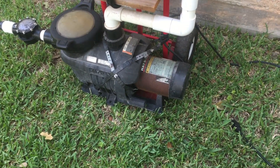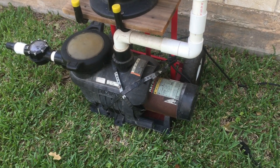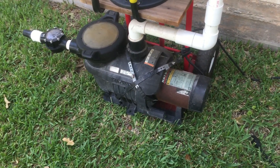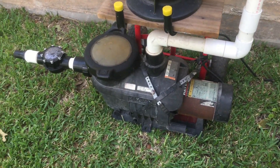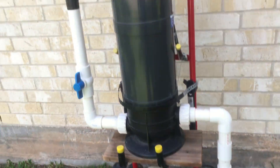If you think about it, above-ground pool pumps always have water coming straight out of the side of the pool, straight down to the front of the pump — that's why they're not self-priming. So if you're going to build a portable vacuum unit, I would suggest you use an in-ground type self-priming pool pump. I use this on commercial pools.